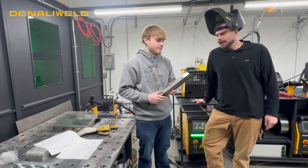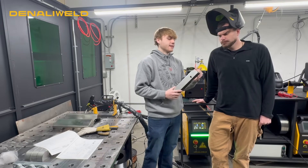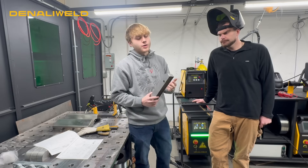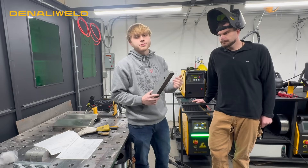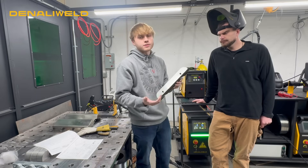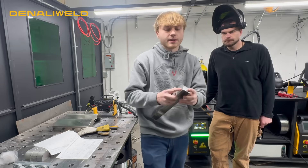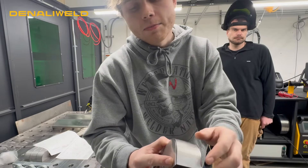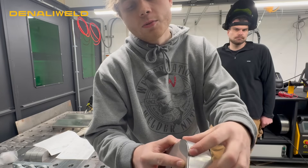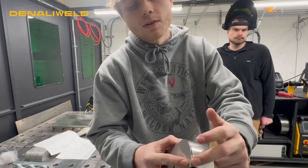Zach, what are you looking at for the right application and joint configuration for laser welding? With laser, it is a little bit more specific than most general welding. Really, the size of the gap that you can fill is about the size of your wire. In this case we're running .035, so an .035 gap. An ideal joint for what we're doing would be something like this. You can see we've got good fit-up, minimal gap in there. On this outside corner here, we have both lands that we can kind of set that wire in, and we're able to follow this corner all the way through.